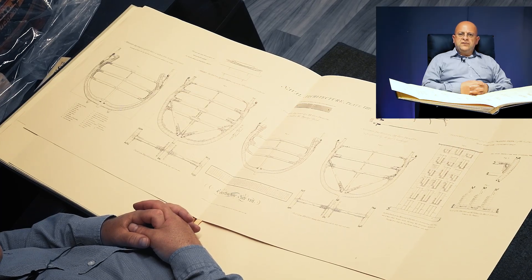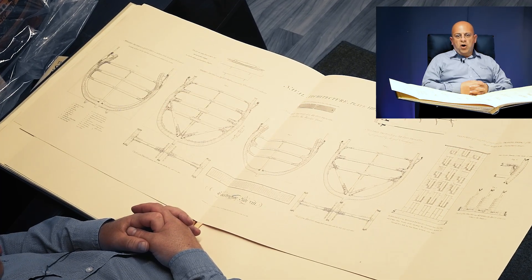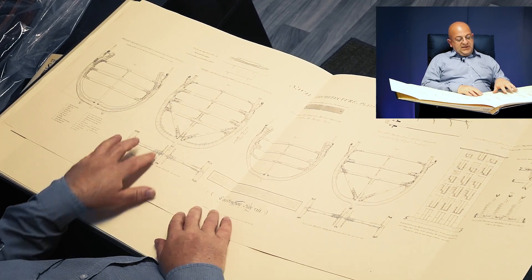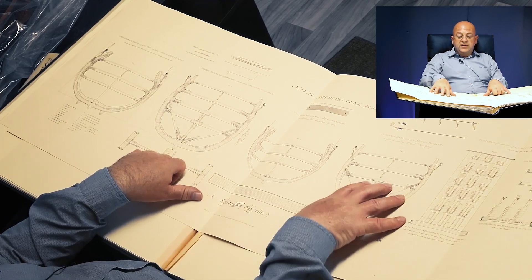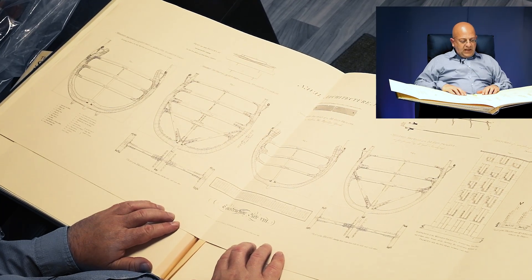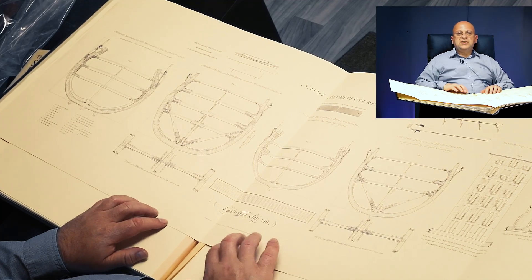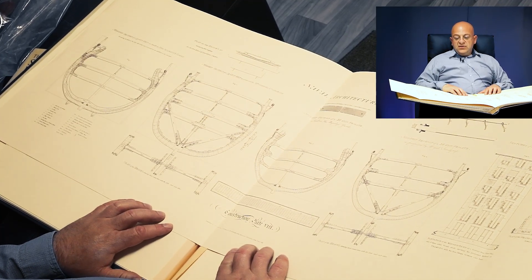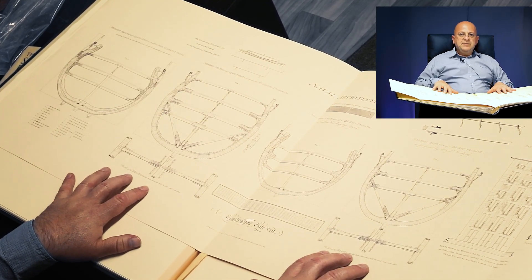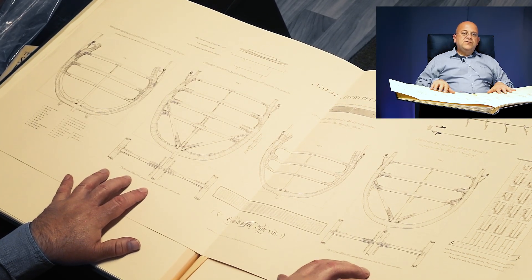The details may change — for example, he uses a lot of strap iron to fasten these cross timbers to strengthen them. Instead of crossing from one side of the vessel diagonally across to the opposite side, in this case they are bracing the beams down to the keelson, each on each side, as is visible here in these two illustrations. One is a classical 36-gun frigate, the other is a typical 74-gun ship of the line. In both cases these timbers add an enormous amount of strength, reviving vessels without complete rebuilding — only with this added bracing system they can be brought back into service and their useful life extended.